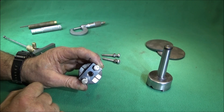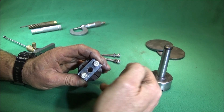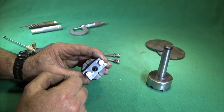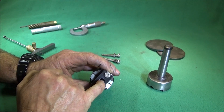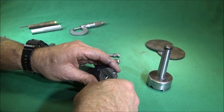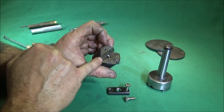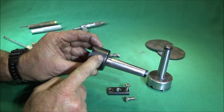If you do that, put a piece of scrap bar in the holder, clamp the front on nice and square, and then just drill down through. All you do is make sure you're clear just past the V and don't go any deeper than that, because otherwise you could weaken the structure of the tool.